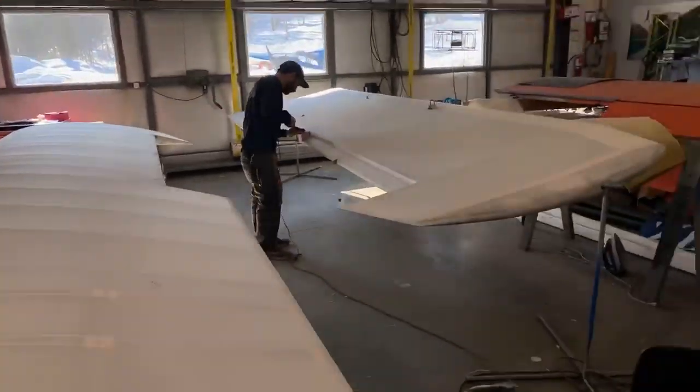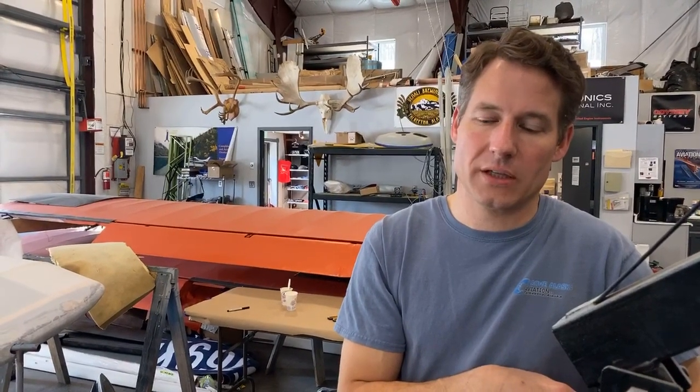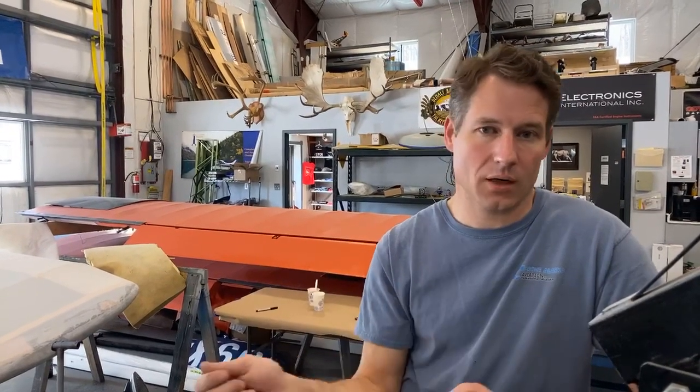And then we have a question: what product did you use to strip the raffle plane? A bunch of them. One of each. My experience with stripping paint is there's no one stripper that will strip all paints. So we usually start out with 3 or 4 different brands and find the one that works the best. What worked the best on this one was a product called Citrus Strip, available at Home Depot, Lowe's. It's citrus based, so it doesn't stink and doesn't burn you if you get it on you. The trick was to cover it with the stripper and then cover the stripper with painter's plastic for at least 24 hours. It works overnight, and then you pull the plastic off and use a scraper. You do that 2 or 3, sometimes 4 times on the thick stuff, and then anything after that is Scotch-Brite or sanding.